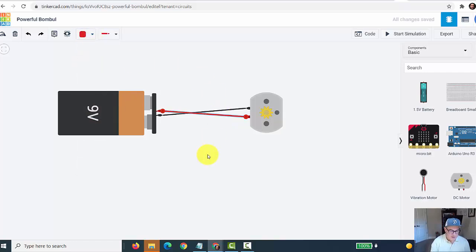I'll stop that simulation, delete the motor, and try something else. This time I'll grab an LED. The LED has two pins — the anode connects to positive and the cathode connects to negative. I'll connect the wires. Now watch what happens when I click 'start simulation': the light turns on, but then you see this explosion — a bubble indicating the LED has burned out. It tells you the current through the LED is 915 milliamps while the absolute maximum is 20 milliamps. There's too much electricity flowing through the LED and it's burnt out.